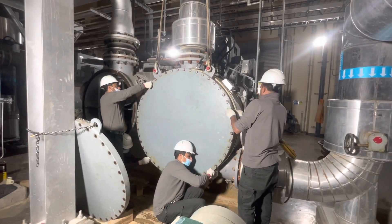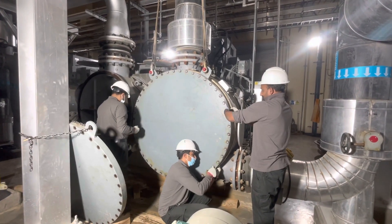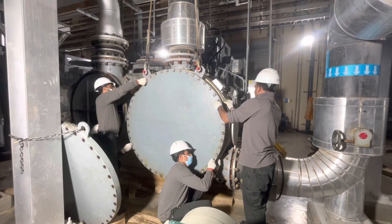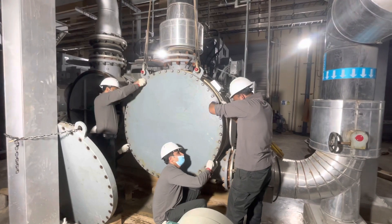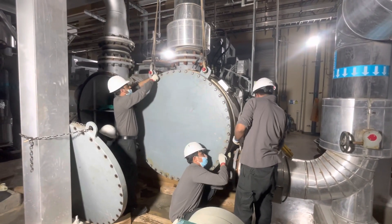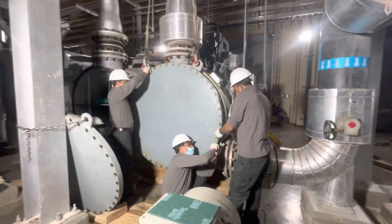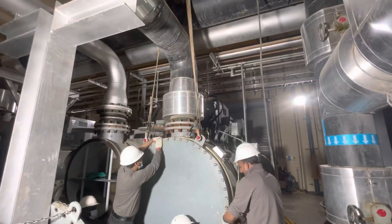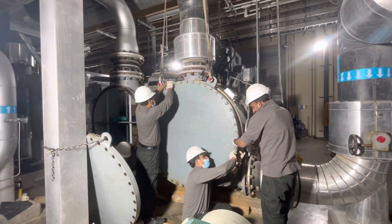All the nuts and bolts are finished — they are fixing the nuts now. After that they will apply torque with the torque wrench. First with the impact wrench they will just tighten everything up, and then finally they will apply proper torque to all the bolts to make them equally tight so we avoid any water leakage. The water flow is two-stage: going in from the bottom and going out from the top — there is an inlet pipe and an outlet pipe, so there should be no mixing. There is also a partition gasket to ensure no mixing and no leakage outside.